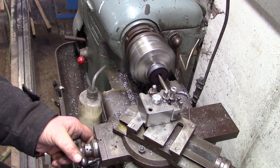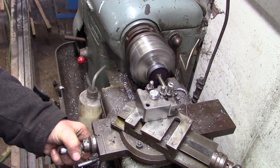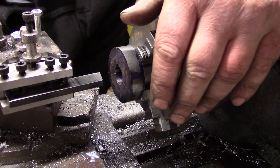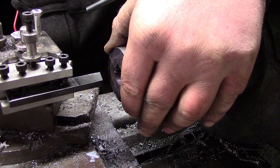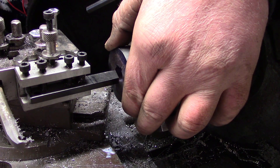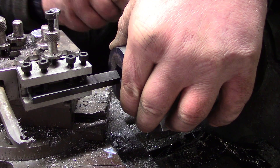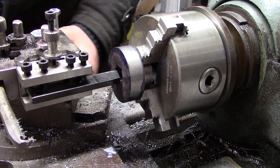Okay, so the first thing I'm making is that groove at the back of the bore. This is an old allen key that I cut up and ground, and now it's a cutting tool for making little cuts in the back of the bore. This is the cutting itself — that black thing in the tool post is my cutting tool. I'm turning the piece around in the chuck with the chuck locked off, lining up the sharp edge of the cutting tool with my mark on the piece. Then I tighten the chuck back up and start cutting.